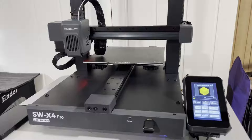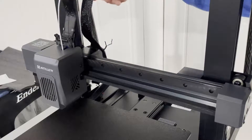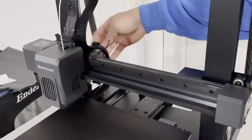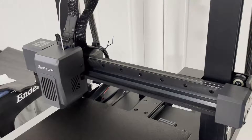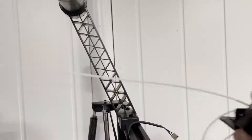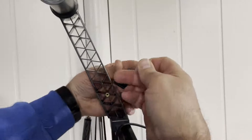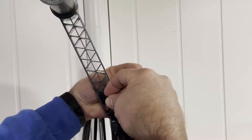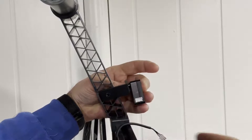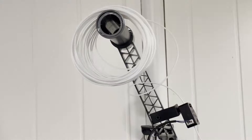Two quick fixes before we get going. First, this cable should not be hanging this low. Shoutout to GOES2012 for the heads up — it was dragging before. I've taken one of the twist ties that came with the printer and twist-tied the cable to the loop so it can't sag. Second, I had the filament holder attached vertically, which is incorrect. I'm pulling the filament all the way back through — though really you should just snip it and start over. The edge connects here, that screw lines up, and the filament will dangle out front the correct way. Everything is now set up as it's supposed to be.